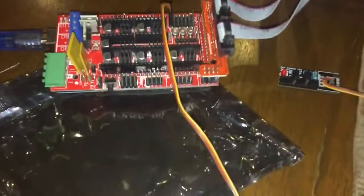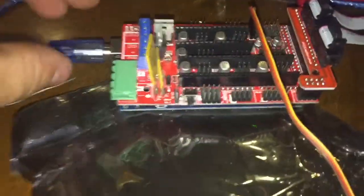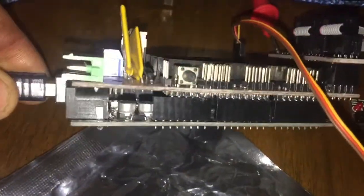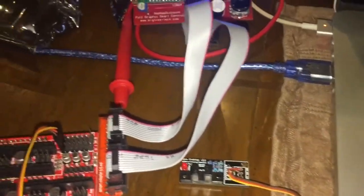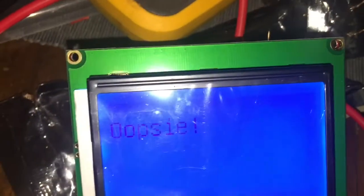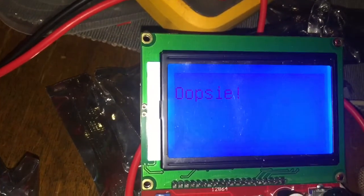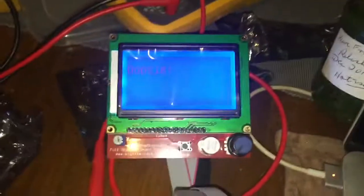The first part I'm working on is grabbing one of the RAMPS Arduino Mega Pololu shield boards that I use for my 3D printers, hooked on top of an Arduino. I've got an LCD shield which is just a 128 by 64 dot matrix, and I started by wiring in an optical end stop. As you can see it's actuating, and based on that actuation I'm triggering a piece of code to change the text on the screen — function one is basically detecting the sensor and presenting something on screen.